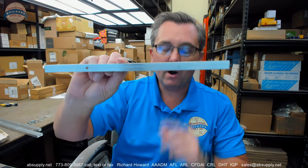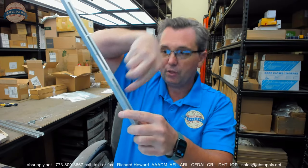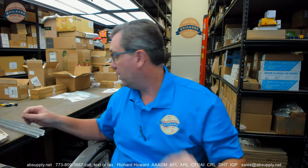And we're going to go through the installation instructions. Then you have this angle bar that is going to separate two of the channels and give you the ability to adjust the bottom leg, as well as adjusting the templates on the U channel, the slotted U channels as well. Then you're going to get a series of screws and nuts and nails. These truss head style screws are attaching the template to the back side of the aluminum channel. This will go through here and then screw into your template. You're going to get trim head nails, and that's for actually nailing the templates to the edge of the door or to the frame itself.